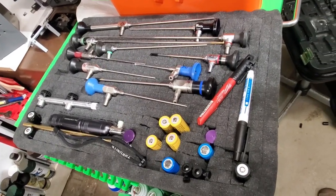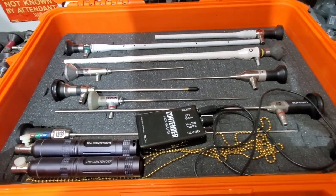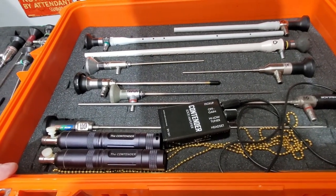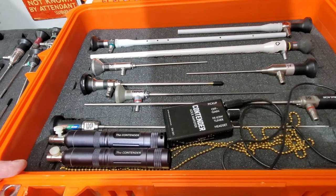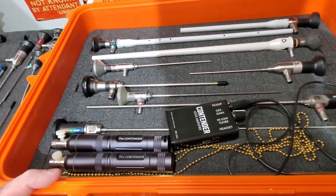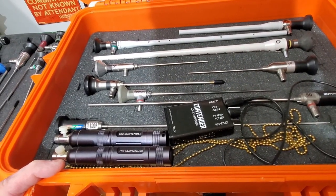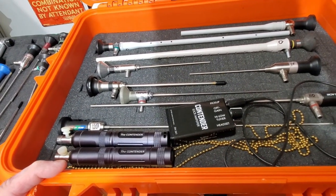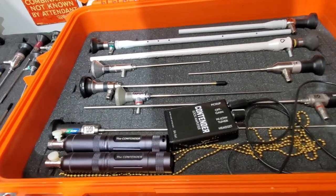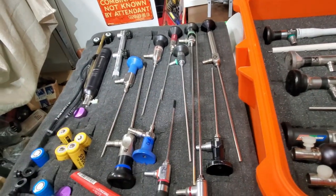If I can troubleshoot from the outside, that's what I'm doing. Today I'm going to do the antique — troubleshoot it and see what model's in there. He has no combination; it's probably a 1920s–1930s safe. I'm guessing Yale is the maker of the safe lock. So it's going to be one of two things. To know what's behind the door, I have to do some dialing diagnostics, which will tell me how I'm going to drill it — just an eighth-inch hole, 2.7 millimeters.